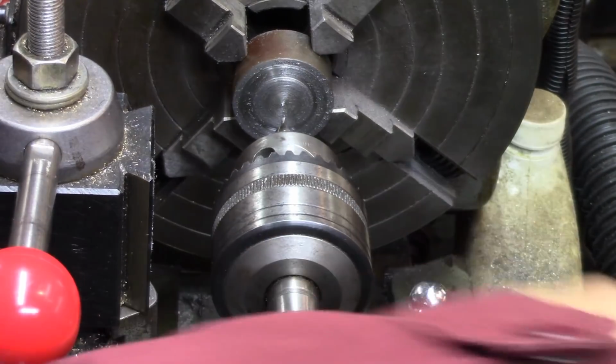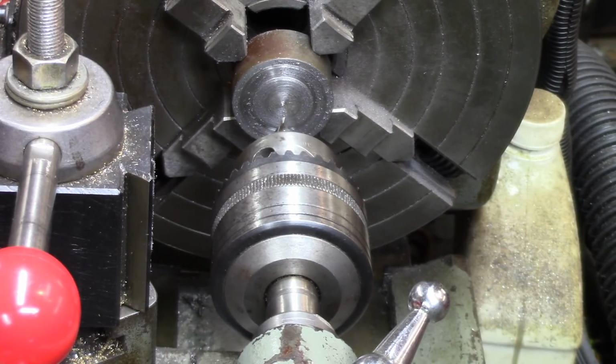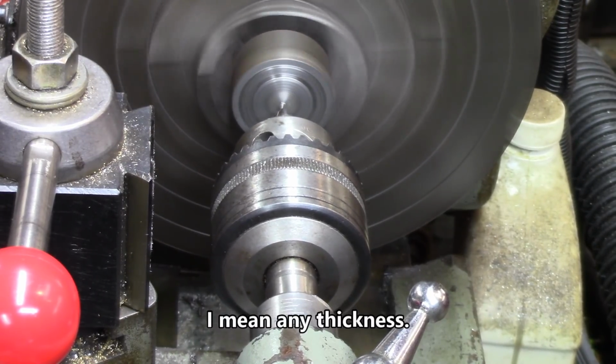so I guess we'll do a little machining instead. This is the cap that will go on the slitting saw arbor. I'm going to put a 1/2 inch hole through it because my bolt is a 1/2 inch, and then I'll cup out the inside of this a little bit and we'll part it off, and then I can take the bolt and make the bolt head a little smaller, if I think I need to. But this will hold any size of slitting saw because it'll go right over the end and be really tight. Alright, I might as well just quit talking and get on with it.